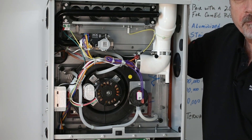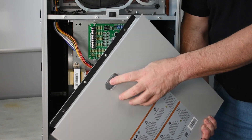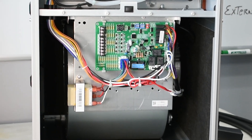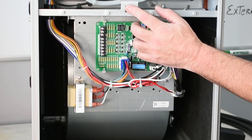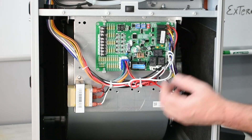Let's look at the bottom part. Even the lower door has a little window, and it's a good-sized window so you can see the diagnostic codes before taking off the door — I like that a lot. Down here is the blower door safety switch, pretty simple, and I like that it's got screws on each side to keep it tight.